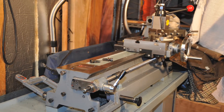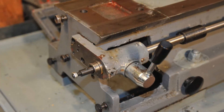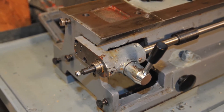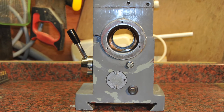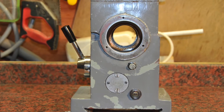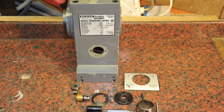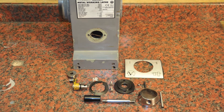The headstock is held by a couple of grub screws onto the dovetail and two bolts from underneath. Headstock alignment is achieved by adjusting the grub screws and locking with the bolts — crude but effective. The spindle bearings were good quality, no need to replace those. Inside the headstock casting it was all clean, no grit or debris.